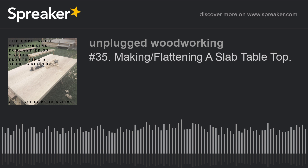So when I started jointing them, I'm going backwards and forwards. I'm checking for square with my combination square. I'm using my straight edge. I'm trying to get it as straight as possible. I've done that with the 2 edges that I'm jointing. And then what I ended up doing was getting one slab and putting it on top of the other slab, where they're jointing, so I've got the final width sticking up on my Roman workbench. I just had to keep presenting it like that, marking it with my pencil where there were any discrepancies. It definitely would have been a lot better to have a longer straight edge, 100%.